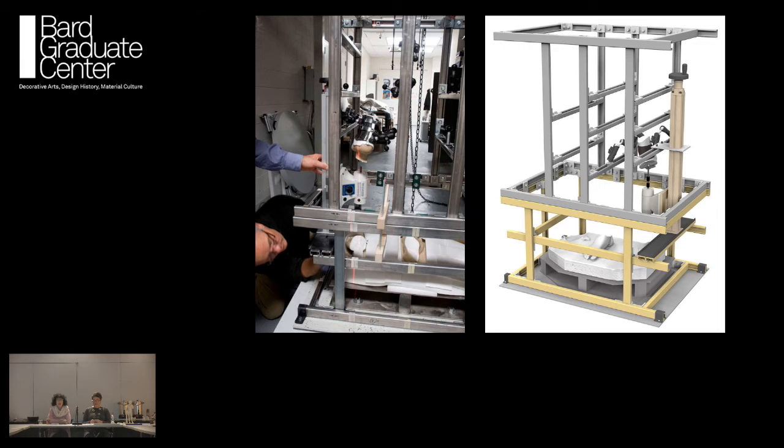With the decision made, we set about creating a drilling armature designed to make perfectly aligned holes, thereby working towards our goal of minimal intervention. The fragment to be drilled was aligned to its mate, and then along with its surrounding rigid armature, seen here in gray in the diagram, it was lifted straight up from the base, and a riser, shown in yellow here, was put into its place.